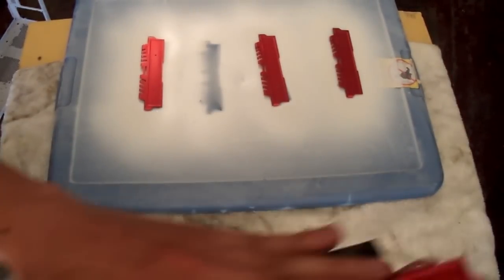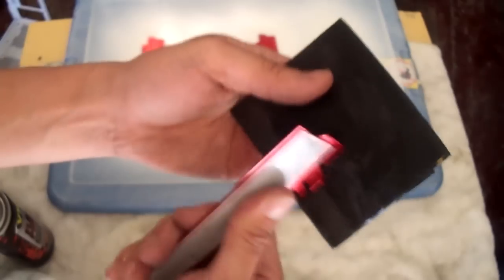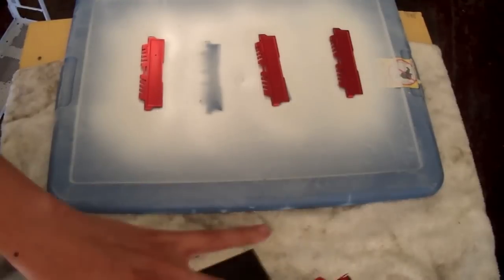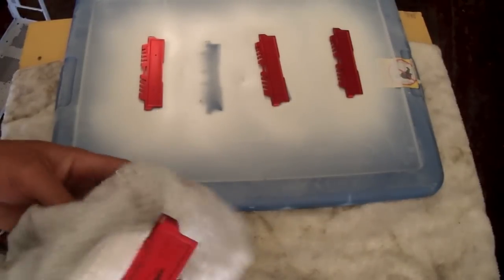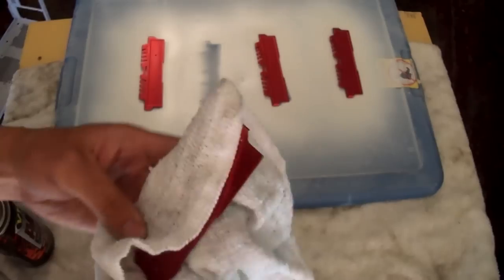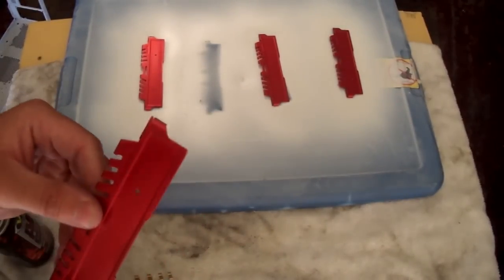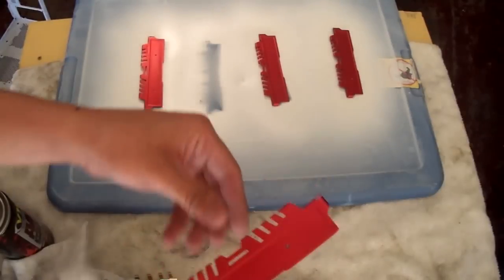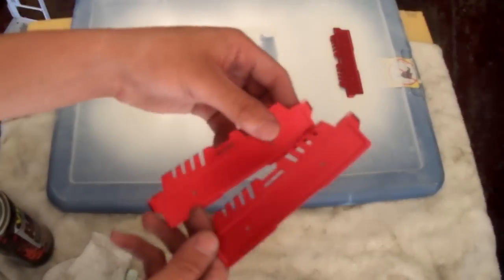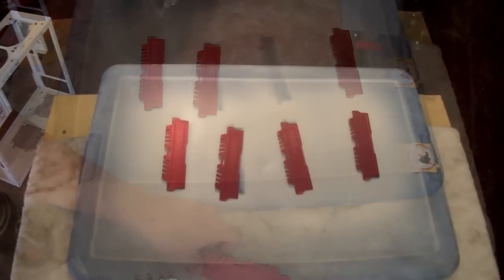I like to put a little bit of water on the sandpaper to make sure I don't get any deep scratches. I'm basically doing this to remove any extra residue and to rough up the glossy surface so the paint will adhere better. This is always a good practice on anything you're painting, especially if it's shiny or has a smooth clear coat finish. You can tell there's a gloss difference once I'm done — hard to tell on camera, but it'll help the paint adhere.